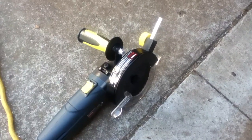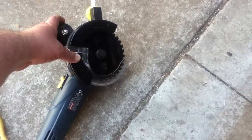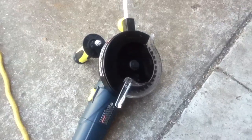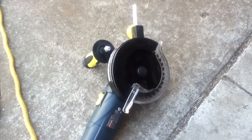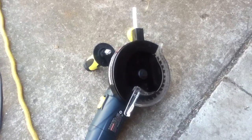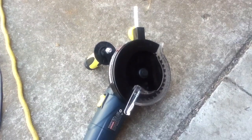The other thing I'm finding is that in cutting the metal, I lost a couple of carbide teeth — they came off the blade. So blade wear is an issue. You might run into jobs where blade wear is just part of the cost of doing the job, because other types of equipment that will do that level of cutting is much less portable.